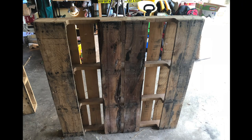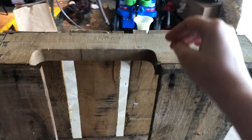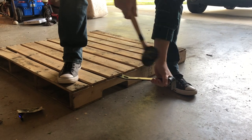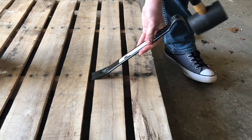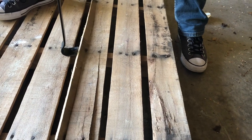I was lucky enough to find some free pallet wood from my parents' farm. We picked out the two best pallets we could find. You can get one to two shelves out of one pallet depending on how good your wood is and if you don't mess up too many times. Before working on the pallet, we had to remove the two boards on each end, then cut straight down with a simple jigsaw we got for around 25 or 30 dollars. My hubby used a crowbar and mallet to remove the boards — easy on the edges, but the middle nails weren't budging and the wood started splitting.